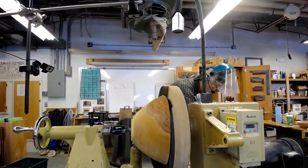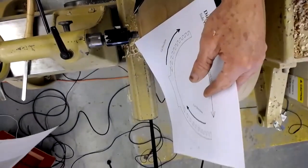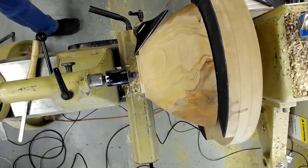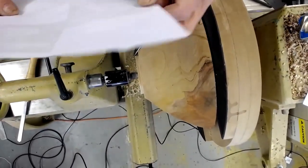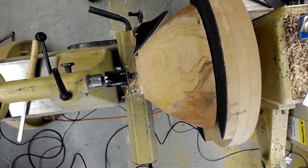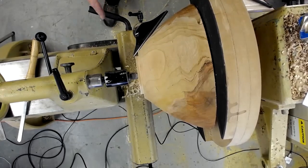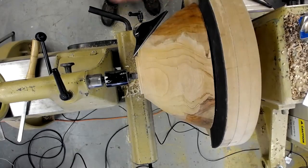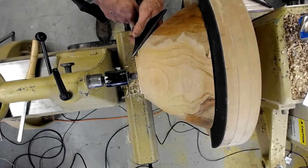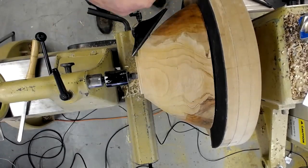I brought some handouts if you want for later on. First of all, this is a sheet on making the jam chuck. But if you go on to Glenn Lucas, he shows you how to make it. But God, it's really simple to do. There's nothing fancy about it. And the more I use it, the more I'm really pleased with what it does. The one disadvantage with this jam chuck plate is that it's really hard to use a 12-inch tool rest. So I have a 4-inch one that I use in this case.